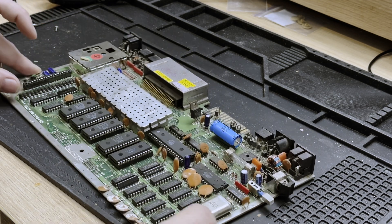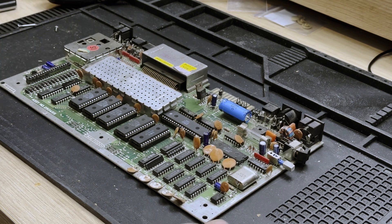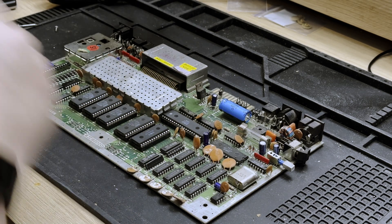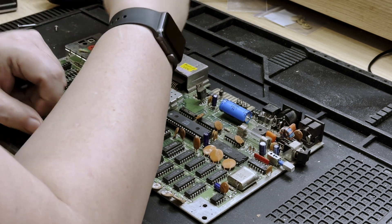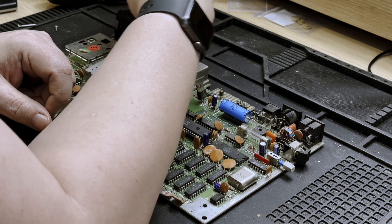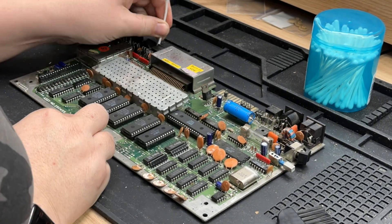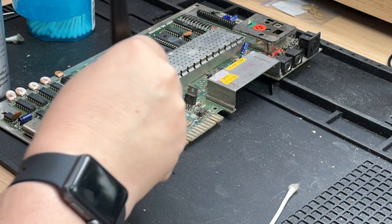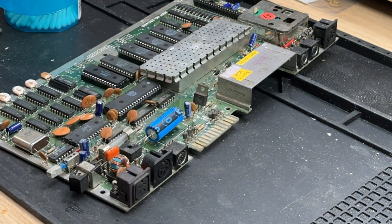So the recapping didn't go according to plan. Nevertheless, we did get the job done and now it's time to actually clean that board and hopefully clean up those disc capacitors. Let's start with a little IPA and hopefully get a brush in there. This is going to take a while — how about we speed things up a little? This board is a real pain in the neck to try and clean. There are little tiny areas where barely a cotton bud will get in there, but nonetheless with a brush, a cotton bud, and a lot of time, we can get it clean.